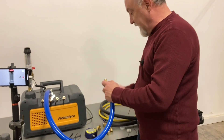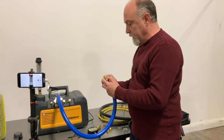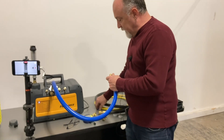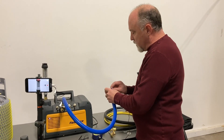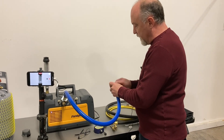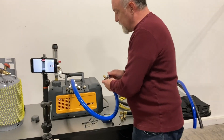You can see that both these hoses do pretty well when it comes to initial degassing — pulling that system down and getting the initial atmosphere out. But there's a big difference in these two hoses in how they perform when we're talking about transitional and molecular flow. So I'm going to swap these back, put the quarter-inch end back on, and we're going to test these two hoses side by side.